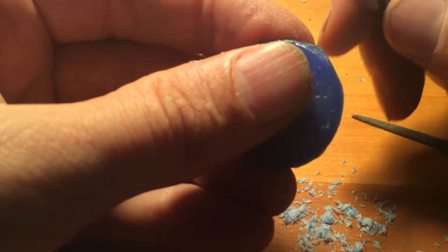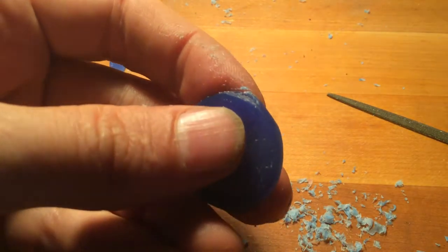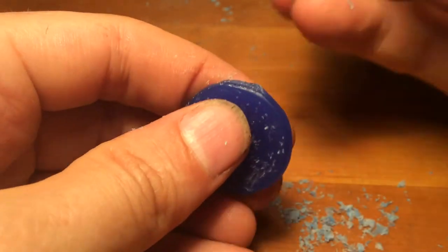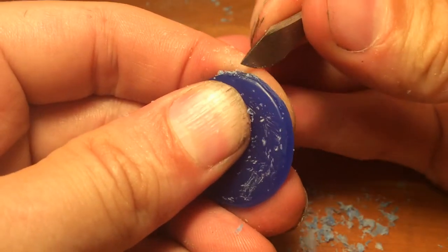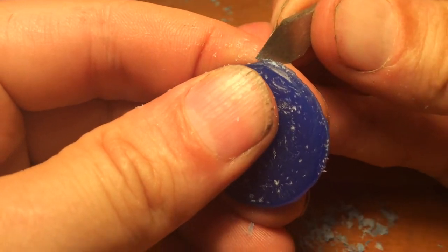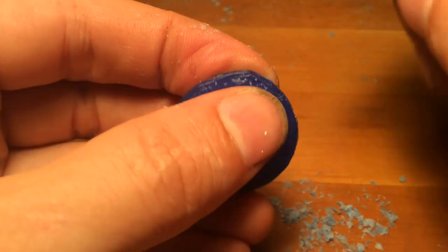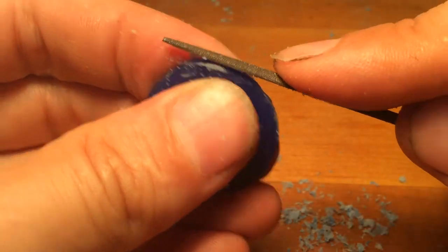Once that's done, we'll be in a good spot. If you've got a little bit left, you can just carve it down — just a little bump. Usually when you're doing a tangency, when that circle comes to a termination at the end of a square edge, it's going to give you the most grief. Depending on your preference, you may want the file or you may want the spoonie tool, but I usually find the file is good for that last rounding bit.